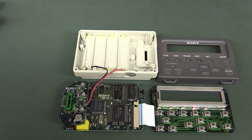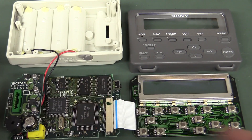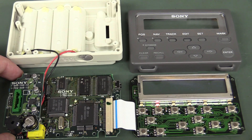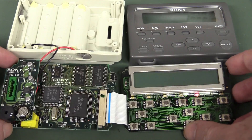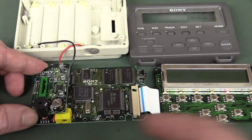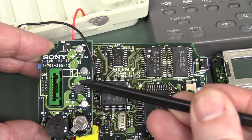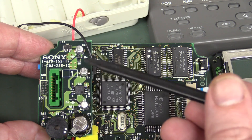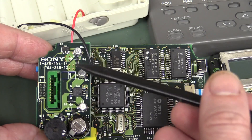The first thing I've done is disconnect the receiver and put it out of the way, since we're focused on just the processor and the LCD. I've repowered it — without the receiver there, it gives some sort of error with multiple beeps but still goes between the various modes. I'd still expect to see something on the LCD with that disconnected. With that disconnected, we can take this top board off — it's got the super cap on it. There looks to be some power supply stuff here: large traces coming in and out, caps either side — input bypass cap and output bypass cap — so that's probably a regulator. The first rule of troubleshooting: thou shalt test voltages.